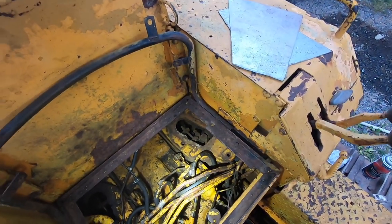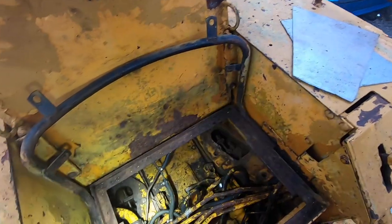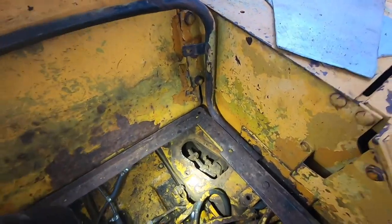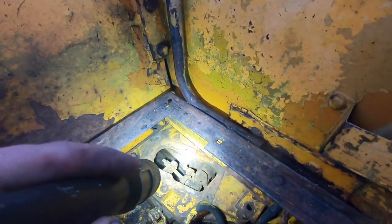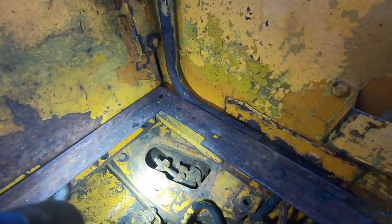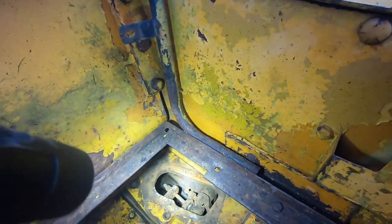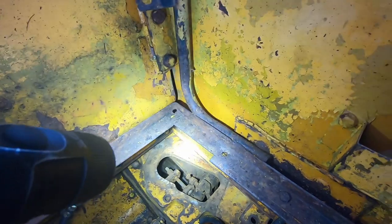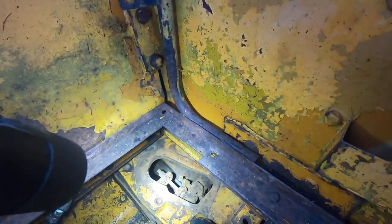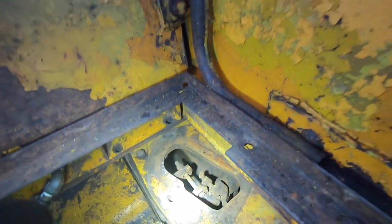So when I went to go look at this dozer, this is what I saw. To the untrained eye, this is probably not concerning, but to anyone that knows these John Deeres, the clutch covers are missing, which is just a wildly terrible way to destroy some steering clutches without even using them. These things are very sensitive to moisture, and they have a lot of issues with seizing up when people leave them sit and things like that. So seeing that the cover is not on here, I'd be surprised if this steering clutch works at all.